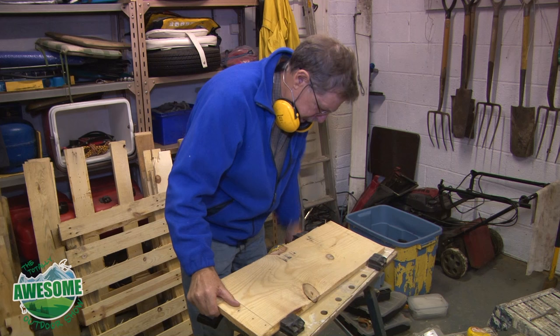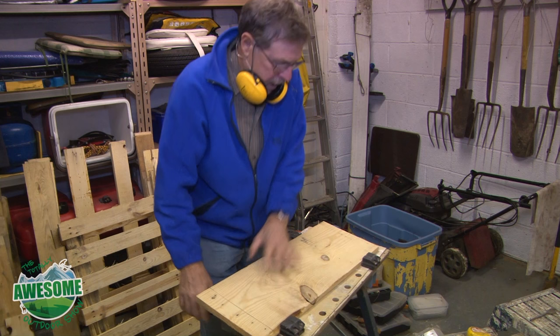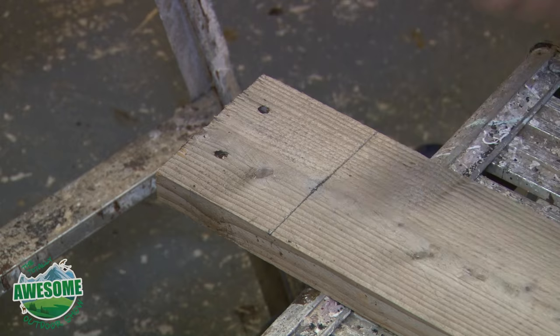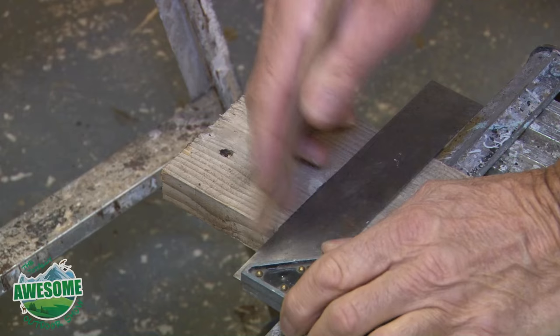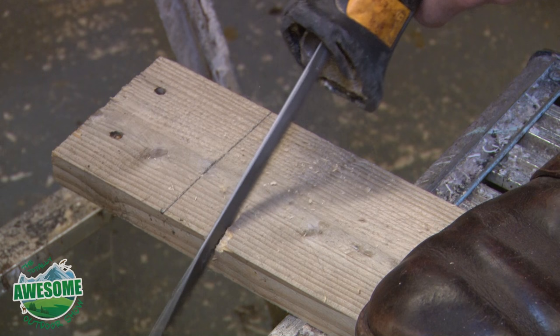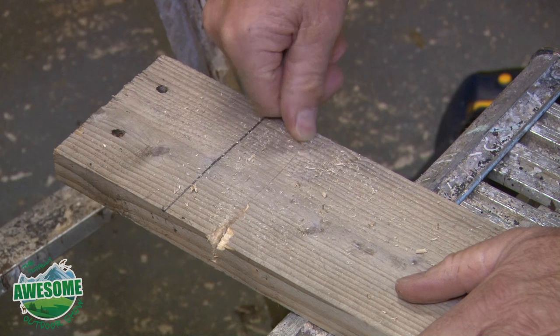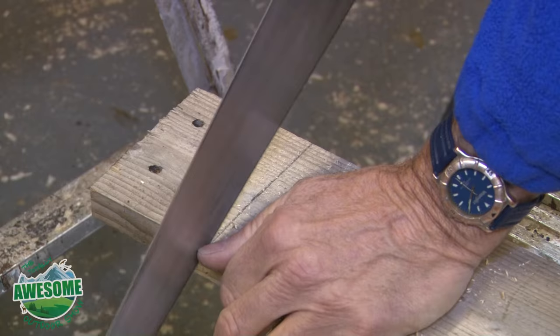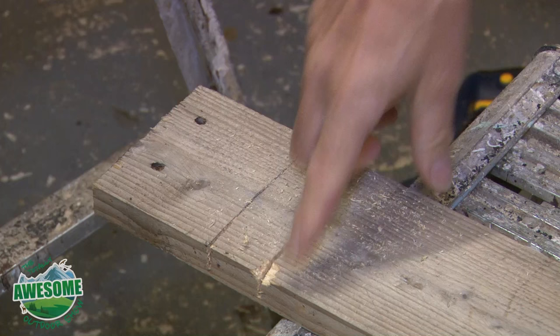I normally use a hop-up but this way saves me bending down. Here's my mark - I've already marked up with my set square. Now, I could cut straight away with the jigsaw but I'll show you what happens generally: trying to get the start of the cut you might see the blade wobble. So to get around that, I just put a groove in with a hand saw just at the top - that's all it takes to get it started.